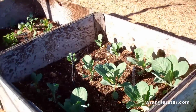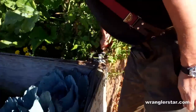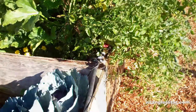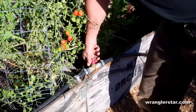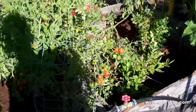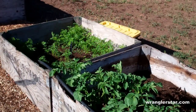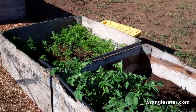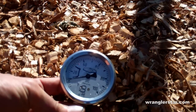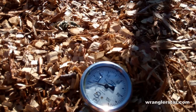It's a combination of soaker hoses and different sprinklers — that's working great. Now we'll open zone two, which is all soaker hoses, so you won't see much but it is taking water out of the system. And last but not least, zone three with spinner heads. With all three zones open and all sprinkler heads running, there's plenty of pressure and plenty of volume — much improved over running directly off the ram pump. With all the watering sprinklers open, we've only lost one pound of pressure, which tells me there's plenty of room to expand. We can add many more sprinklers without having to divide them into so many zones.